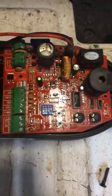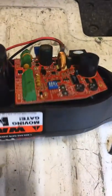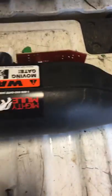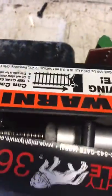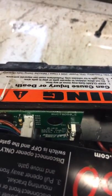You have to take that apart in order to get to the micro switch for your open and close, your stop position, or your gate. Once you get everything torn apart, you can just open this up — this pulls apart — and you can see that's where the other circuit board is with that switch. That is the switch that has failed on me. The second one I just put in lasted less than 10 days.